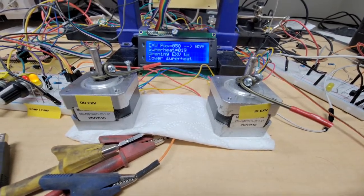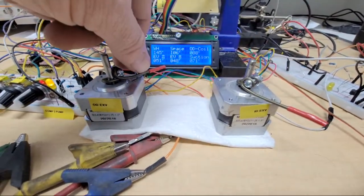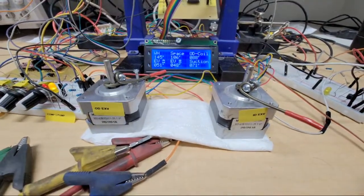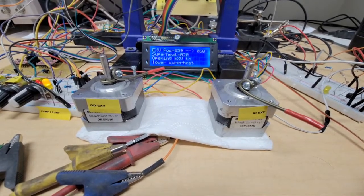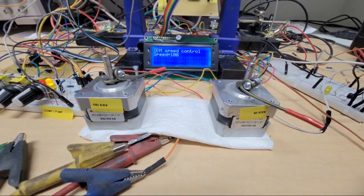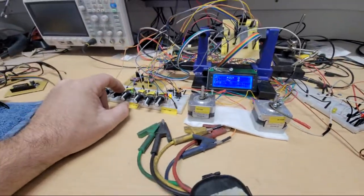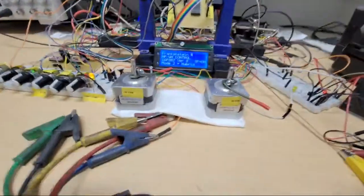So, did you see it? And eventually this thing will just keep going all the way around. I just put the screws in there to kind of stop it for when they home. It just keeps opening that expansion valve. And then if I'm going to cool off the outdoor coil, it's going to start slowing down this fan right here.